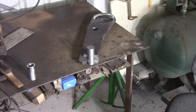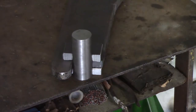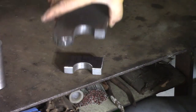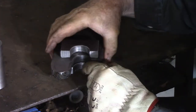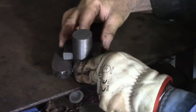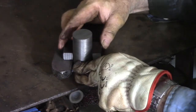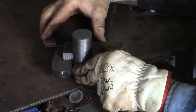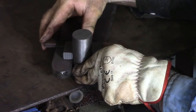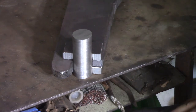The first part of the process of assembling these: I'm going to put the stirrup onto the keel post. I've just sat this there lining it up — this is the stirrup, that's the keel post. I've got it all leveled up there with another stirrup underneath to try and make sure I get it all lined up the best I can. Make sure that this goes into the post perfectly. Push the stirrup up to it — while it's not all that critical, the plans do call for it to be at right angles with the back post, so I am using a square just to line it up.